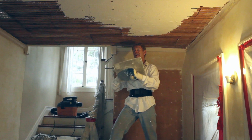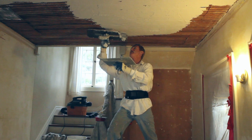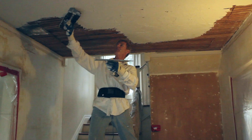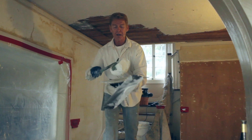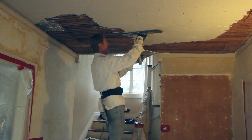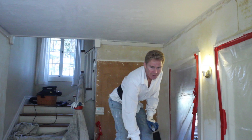Watch your foot — you don't want to fall through the plank. As you're working, try to keep the wall or ceiling as smooth as possible, because that can be your whole base coat. When we did hospitals and schools we did three-eighths at a time — three-eighths for the first coat, three-eighths for the second, totaling seven-eighths to an inch. But for residential like this, they're only a half inch, so we can get away with a quarter to half inch. Then I'll show you how to put on the white coat, or the diamond veneer finish.